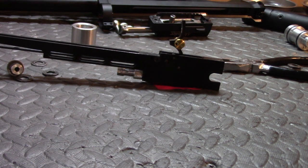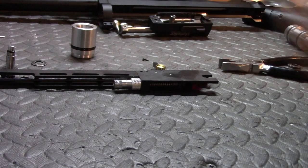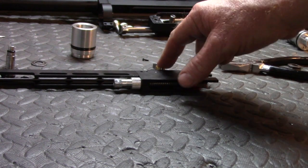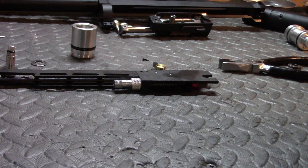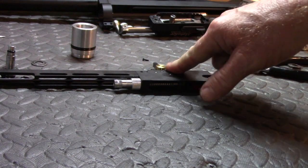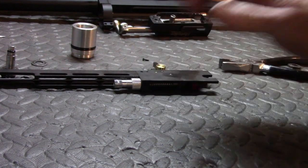That's choice number one. That is a bad choice. Choice number two is to match your valve dwell time with the weight of the hammer. What this does is allows you to actually use a little less hammer spring tension, get a little bit more force and inertia out of the hammer without really damaging the system. So the hammer weight is the key to the system.